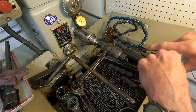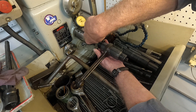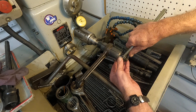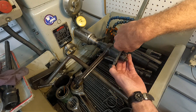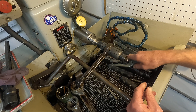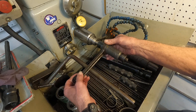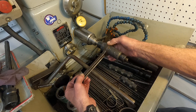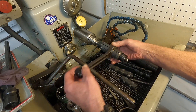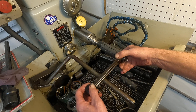I need to adjust it, so I'm going to start pushing that lap up that taper. I back this one back just a bit and grab this — this tool is a bicycle tool, but it works. That's quite a bit tighter. You have to keep moving across the lap and it self-trues if you do that. I'm going to pull it off. You don't want to try to remove the rod with this thing spinning — it'll catch on the end and be a disaster.